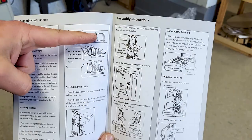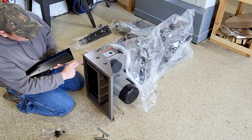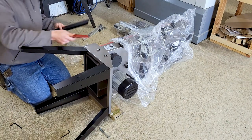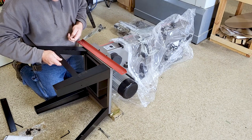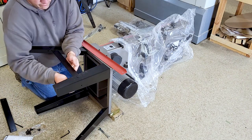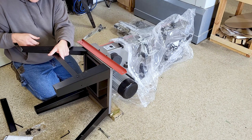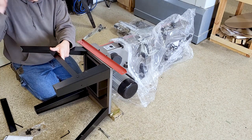This is why I've set it up — because this is what was said to be done in the manual. All we're going to do is take two of these little M8 socket heads with two washers and pop these on into here, through there. So now the legs are on. What we're going to do is take the bracing — we have two shorts and two longs. We'll orientate it with this lip on the top, and the holes are square because there's a square section on this bolt. We want a washer on the bottom end and then put the nut in. We're going to hand-tighten all of these, because we want everything to fit together nicely — there's a little bit of movement in it. Fit it all together nicely, and then once it's all together, we'll tighten it down.